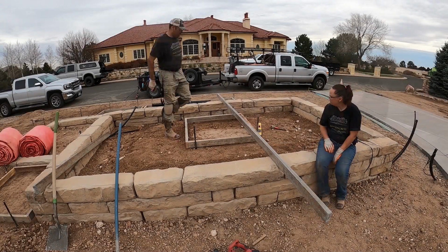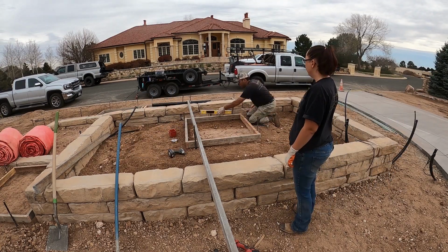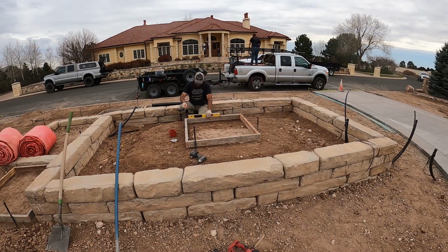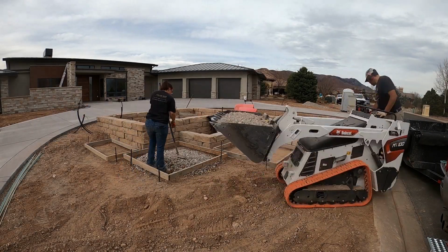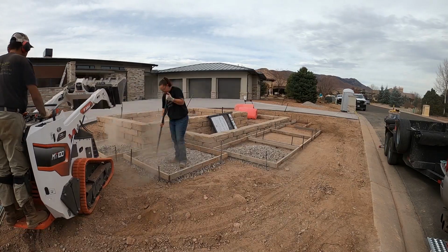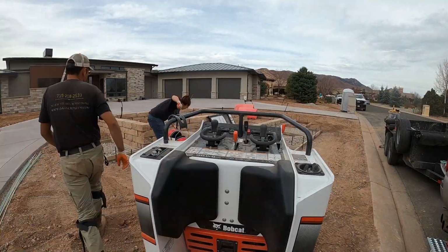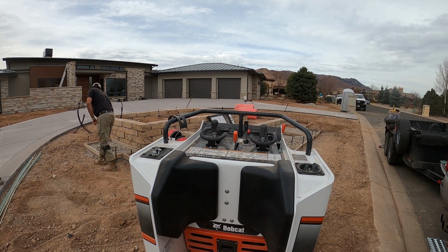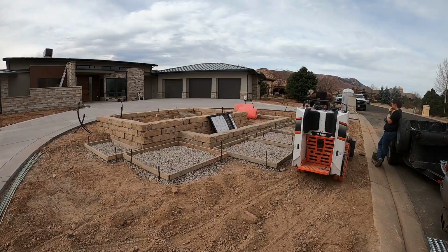So I am certain it'll never move. Oh, and then this one in the center that was built up, but even here the soil was incredibly hard. But all the other ones, the walkway and the other squares around here, just incredibly hard. And then we filled it in with 1.5-inch screen rock, so we're certain these stones will never shift in any direction. But I just wanted to point that out in case anyone was curious why it was taking so long for me to drive those stakes in.